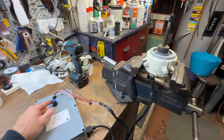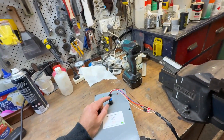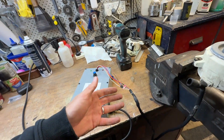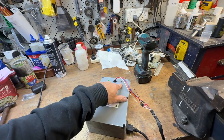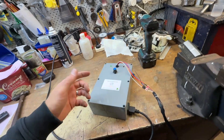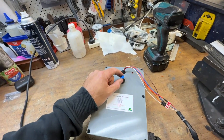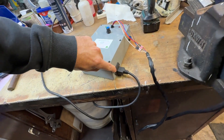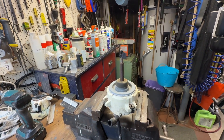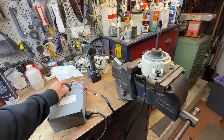I've actually made two of these. The first one I made just with a lead coming out to see if it worked, and when it worked I made a neater version. On the first one, the red light was illuminated whenever it had power, but I changed it so on this version the red light only comes on when it blows a fuse. Green is good, red means a blown fuse — pretty sweet.